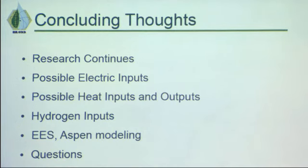It's either one, I think. It will depend on what is easier for the heat process. In some cases, if you are dealing with a lot of different loops already, it might be easier to just transport electricity. We also have some waste light gases. We can burn that light gas to heat up the air. For the distillation, it has to be raised to 350. We are also thinking of using the waste light gas. Instead of just burning it, we can use the heat wherever we need heat, instead of using electricity. In some way we can also reroute heat from the syngas, the gasification reactions, to reheat the air.